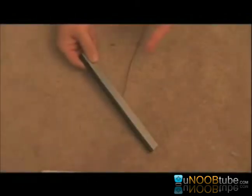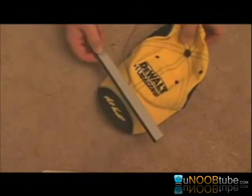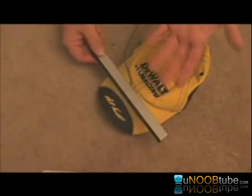The tricky part is we're going to have to find some way to mount the sensor bar onto our head. One common trick is to get a baseball cap and then mount the hardware to the cap — this will definitely work but it's a little bit goofy. So instead, some hardware stores sell safety glasses with LEDs built in on the side meant to be used as headlamps. If you replace the LEDs with infrared ones you essentially get your head-mounted sensor bar in a nice sporty safety goggle form factor.